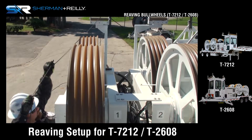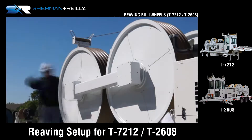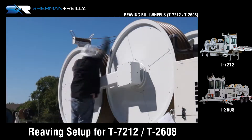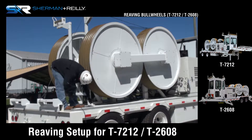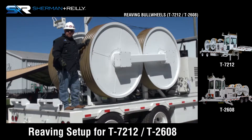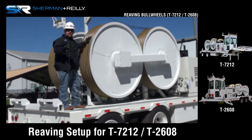I'm going to hit the first groove off the bull wheel. It's important to thread it and hit every groove — you're using the machine to its full potential that way. Everything the computer and onboard readouts are telling you is correct if you thread every groove. When you miss a groove or over-reeve, you're actually hurting yourself and feeding the computer false information. It can't help you to its potential if you over-reeve or under-reeve it.